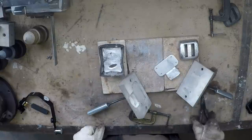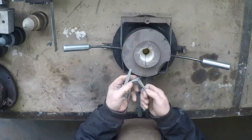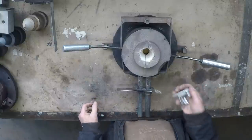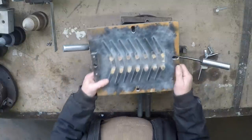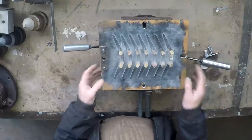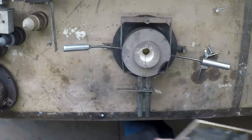I've been asked the question: why bother with gravity die casting? Here's a possible case — say you've made four or five of these aileron cranks for a friend's model aircraft and he says they're great, but he's got a mate who wants hundreds of them. For a small job like that, you can put 14 of them on a plate and sand cast them — it works quite well. You don't always get all 14, but you can rely on 12. Or similarly, I've got 12 little castings on a plate here. That's fine if the castings are small, but what happens when they get bigger?